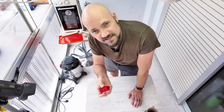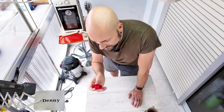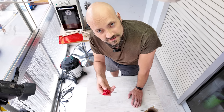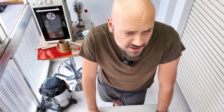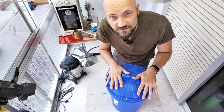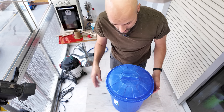Because I'll be casting my Benchy in iron I need to make my mold out of silicon carbide because it can take very high temperatures — you can even cast stainless steel if you want. You might think that silicon carbide is expensive, and you're right, but it depends where you buy it from. I don't buy it in small bags for like 20 euros. Instead I buy them in large 25 kilogram bags from sandblasting stores.